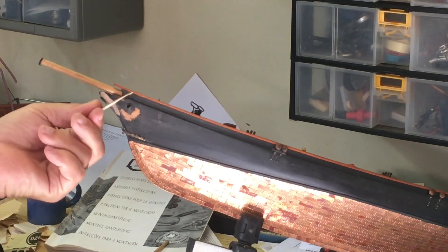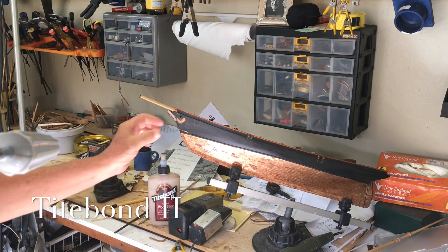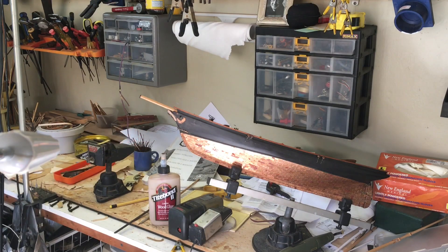I'm sure you can see the bend in it. We're using Titebond which gives us lots of working time, so we can apply the glue with no rush to get the piece in place. Then we leave it for about 8 hours before taking the clamps off.